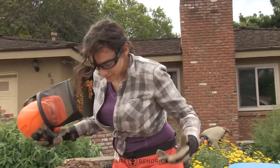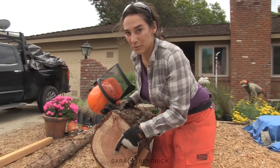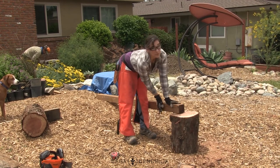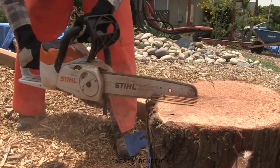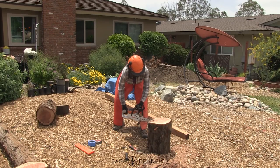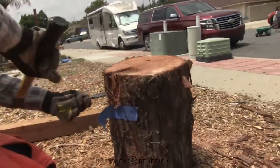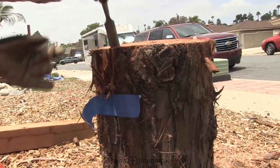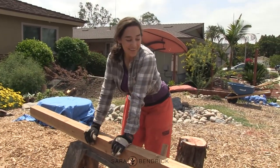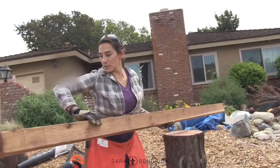All done. Now I'm going to cut notches in the top part here — they're going to fit my 4x4s. I'm using rough dimension lumber for my 4x4, so it's an actual true 4x4, not a 3.5. I'm marking out where I want to cut and notch into my stump. This 4x4 is made out of redwood as well. I'm going to cut it to about 4 feet — that's a good span stump to stump — and then use whatever's left for the second connection from the middle stump to the end stump.